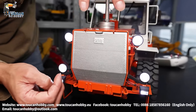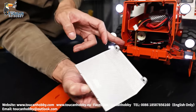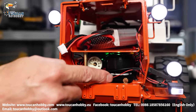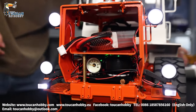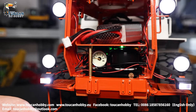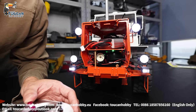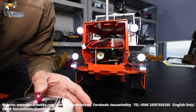Front cover plastic — unlock, this top here, unlock it, lift up, take out. Downside secured by screw, into the hole. So here we put the battery. This position we have the pump, and fill up hydraulic oil from here. Start the pump to see the pressure — pressure gauge. Now pump starts, move the valve. You will see the pressure, around four to five MPa.